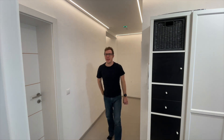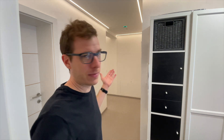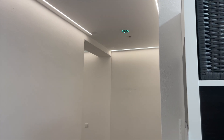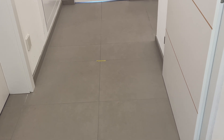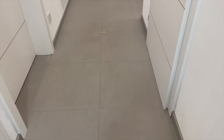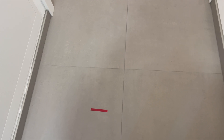One nice feature is presence detection — if I just sit there, it still recognizes me. The infrared sensor would have a very hard time detecting me because it reacts to temperature changes across zones. On the toilet, for example, this is amazing. You can tweak the settings and the turn-off delay. The yellow line shows where the Panasonic passive infrared sensor detected my movements, and the red line shows where the millimeter wave sensor detected my movements. Not bad.